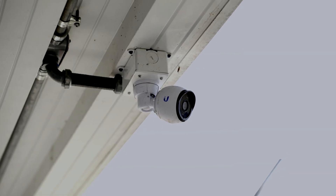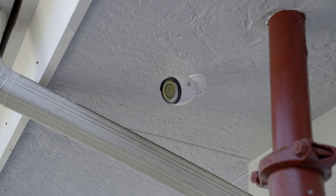For outdoor doors, we went with several camera types. We went with domes primarily above the doors and ways of entry. We also had bullets in two varieties: the G4s and the G4 Pro, which is the 4K variant. We chose cameras depending on the area we're trying to cover — if we're covering a large field, we deployed 4Ks, whereas for a shorter outside hallway we went with the regular G4 Bullets, the non-pro version. Every camera has its purpose. It's not that more expensive is better — there are applications where you wouldn't want to, for example, put a G4 Pro on a drop ceiling tile because it's really heavy and may fall. Choosing cameras correctly makes a big difference in achieving adequate coverage.